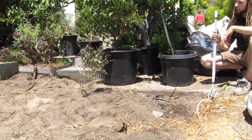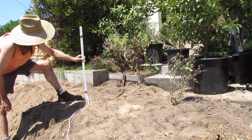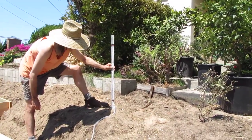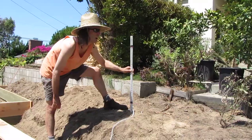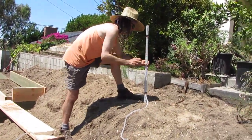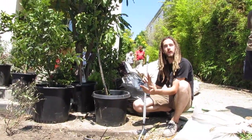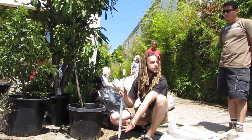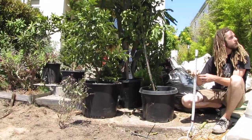So here, right? Yeah. I'm at 22.5. I'm at 23, 23.5. 23-ish. Yep, right here, a little bit above. So do you want to keep it level or sloping a little bit so the water will follow? It depends on the design. Basically, everything below this point is going to be slightly downhill, and we can make these in terms of a drop of 1 foot or 6 inches in elevation, adjusting accordingly for how far we want to make it.